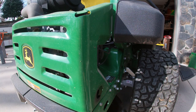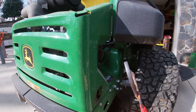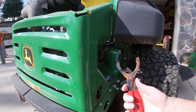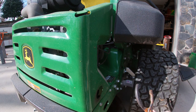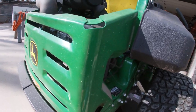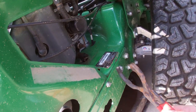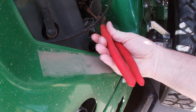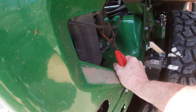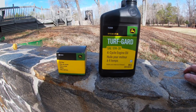This is pretty easy if you've got an oil filter wrench. It's been about a year since I finally got one - I've done this so much the hard way and I cannot tell you this is some of the best money you'll ever spend if you do your own oil changes. Let me get the camera up in here so you can see. You just come up and come down on this, and it should not be much more than finger tight.